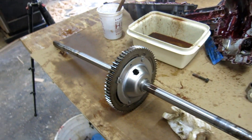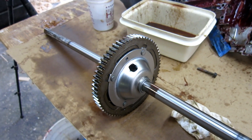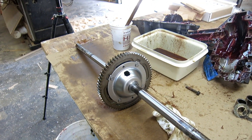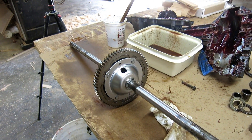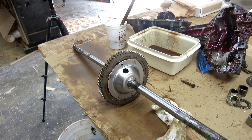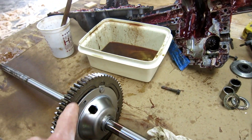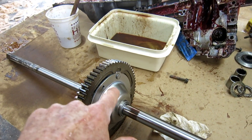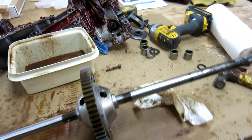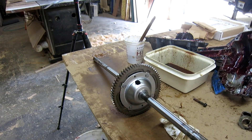This is pretty interesting — this is the differential part right here. It's riveted together, so if I take it apart I have to cut those rivets. But I think I can do that — cut the rivets, get a chain wheel for the drive chain, and use bolts to replace the rivets. I could braze these little holes solid, and caulk this little crack that just holds grease. I can actually put a grease zerk in the little plates. I'm going to cut these rivets off — I hope I'm not sorry about that — and open it up to take a look inside.